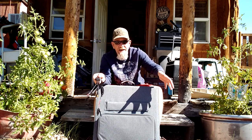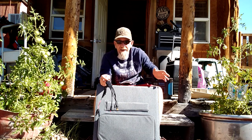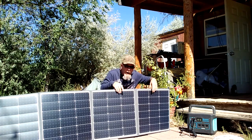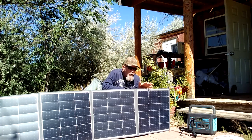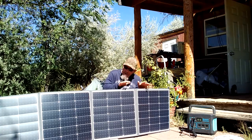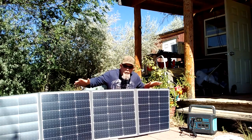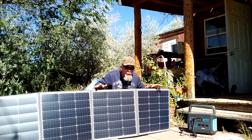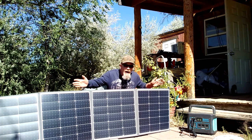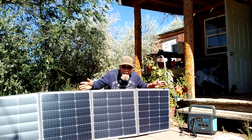Now I'm going to fold this out, show all the panels, and show how it's set up. I'll connect it to my power station and give you a reading of exactly how much power this panel will produce. These are four 50 watt panels. I want to clarify that this is designed for charging up 12 volt systems — it can produce up to 20 volts, so systems that can handle higher voltage will charge faster. This panel is also rated for 23 percent efficiency, where most panels are rated maybe 18 or 19 percent, so it will charge up faster than many other panels out there.